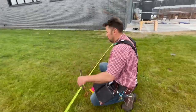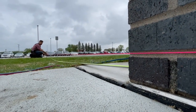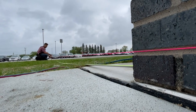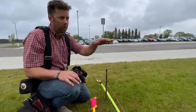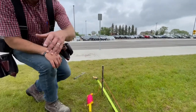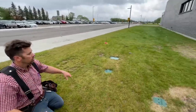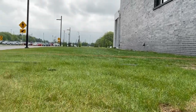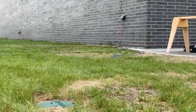Let's see if we can do that. As I raise the line up, just tell me where to go. A little bit higher — it's about good. So I've roughly put a level line up with the building. Looking at it from this direction at ground level, we can see we're level off of the building, but the ground tapers away — which it should. The water has to run away from the building, so we've got proper slope here for drainage.